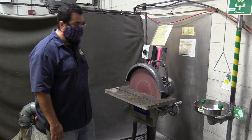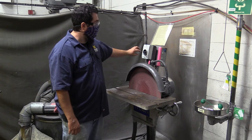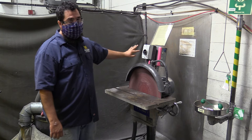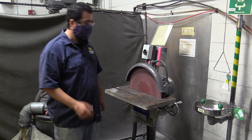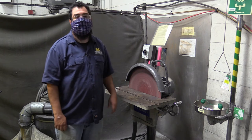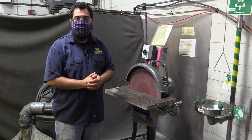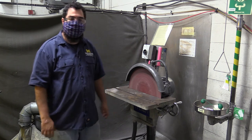Put the dust collection system on. It has a very long spin-down — if I turn it on and then turn it off, it takes about 20 minutes to stop spinning. Do not put your material into it to slow it down; you can hurt the motor and rip the paper. If you have anything with sharp edges, please take the sharp edge off first.